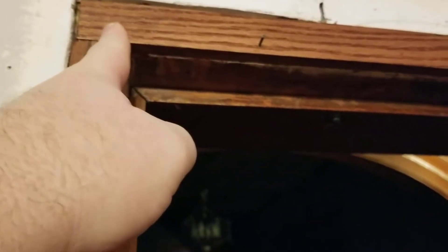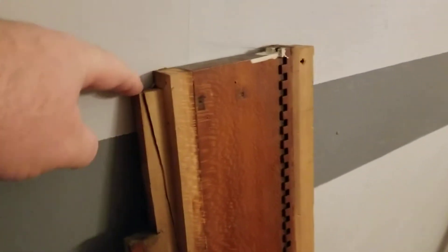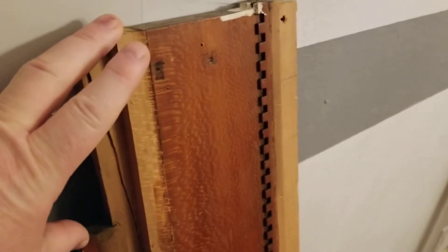What I've been doing is measuring from this point to the bottom point, then measuring that up here — that gives me the listing. You leave three-sixteenths on either side, though it'll probably be more like a quarter inch because of the hinges. You measure that opening and that'll give you that piece, then you just replicate each side with the return edge — create that little cut, carry that cut, and basically add that much to the end of it.